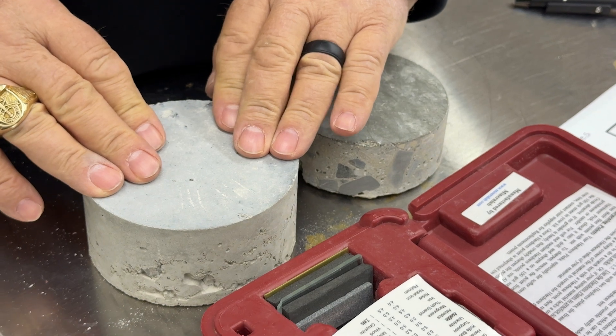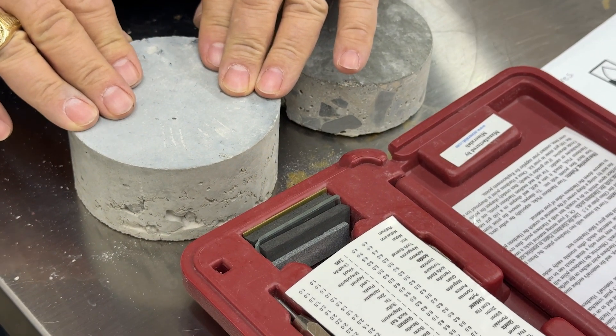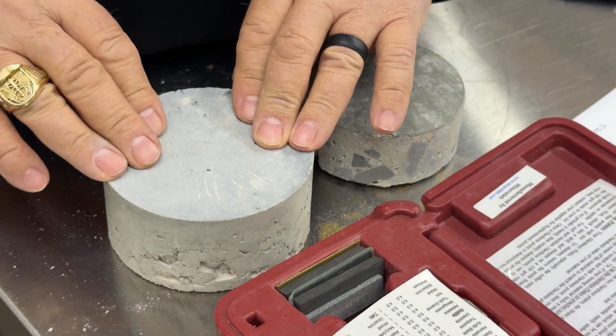When we're going to polish concrete, we want the hardness to be above a four before it scratches. So if you scratch with a five and not a four, you're somewhere between four and five — we call that a 4.5. For polished concrete, we always want to have at least a 4.5 before we start grinding.